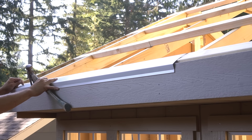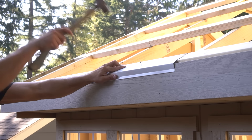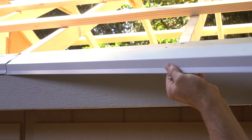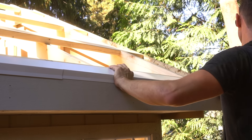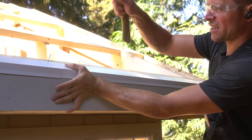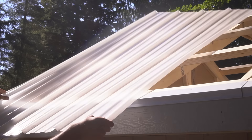Once our fascia boards are installed, I can finally move on to our metal flashing. This is a drip edge flashing that goes up against our fascia board, but also against the 2x4 structural support that we installed previously. I'm using our 2 inch long nails that came with the kit to secure these pieces of flashing in place, and by running the piece of flashing underneath the piece installed previously, we can hopefully prevent any water penetration as well as avoid any cuts needed for our flashing.